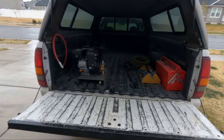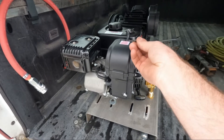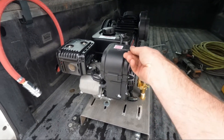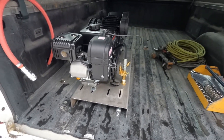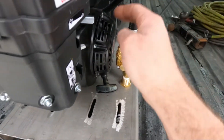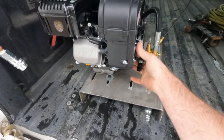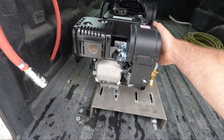I'll fire this thing up. I've got to figure out this throttle - it slips. I need some way to better clamp it so it quits moving, because it'll idle and kick up and down like it should for a few times but then it slips back to where it idles so low that when it kicks up it just dies. The unloader still works, but I'm just going to run the throttle manually for now.